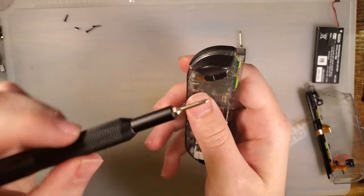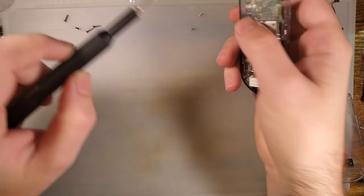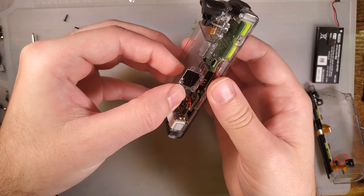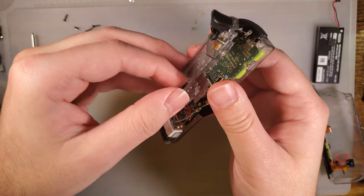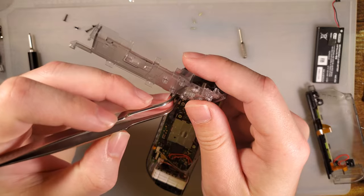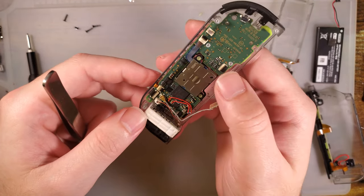not a, whatchamacallit, a fuse. Again, I am still quite confused on that front. I don't know why, but in my research, when I searched for 0201 size fuses, I found a whopping nothing, which led me to look into something that I know uses a similarly sized component for a similar function. So if we were to reference iPhones, I know they have a fuse for the backlight, quote unquote fuse. It turns out those do the exact same thing.